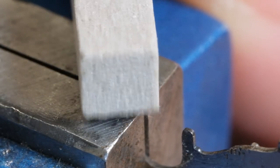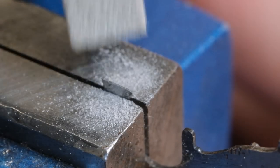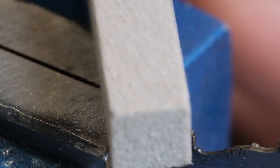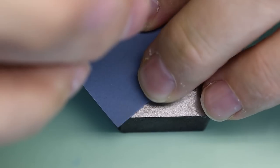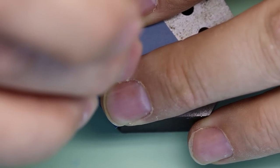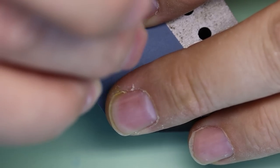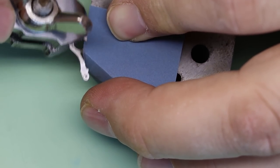So we're first going to level it and then we're going to polish it. Very important that there's as little friction as possible when this one hits the heart-shaped cams. I'm first using a stone to level the face of the hammer — actually both hammers. And then we're going to put them in a handheld vise and polish the surfaces using from 800 grit up to 5000, to make sure we get a very smooth and nice surface. We also need to polish the sides of the surface to make sure there are no ragged edges that can interfere with the reset.